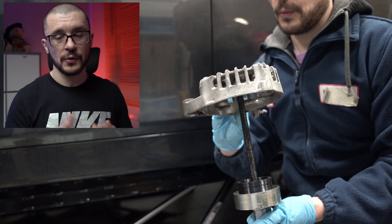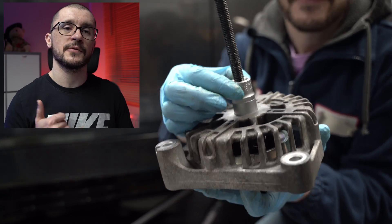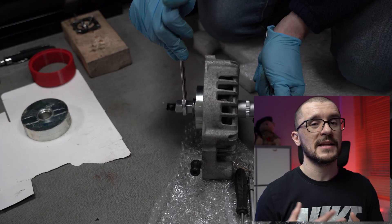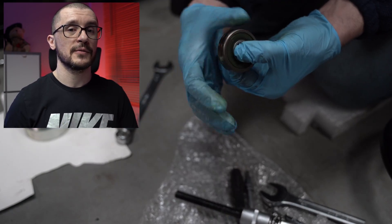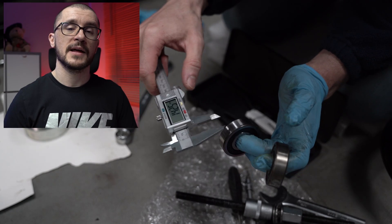With adequate support you can pull out the stator. In my case I went for using a bushing extractor that I used for the differential, however it was a bit of overkill. I've noticed that the force needed to remove that bearing wasn't that much, so you can use a socket and a hammer to hammer out that bearing. Just make sure that you support the case to not damage it.